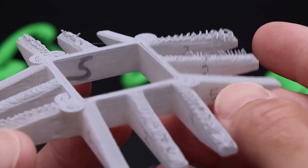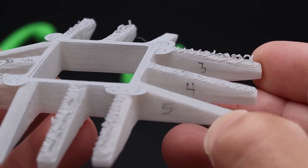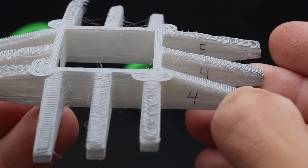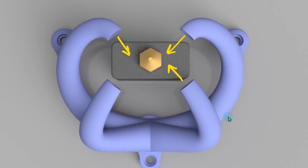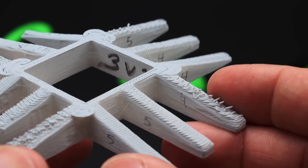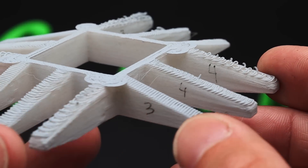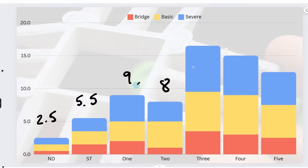The five-ducted Sentinel could have done better — I didn't do a good enough job balancing the flow and ended up sending a lot of air from the back and not as much from the other four ducts. The four-ducted version, which was just the five with tape over the rear auxiliary port, did better by a small margin. Both the five and four versions are sending streams slightly off-center from the nozzle, ending up creating more turbulent flow. With the best overall score, we have the three-ducted version. It's much more balanced, the airflow creates more of a vortex effect, air is directed around rather than directly at the nozzle, and warm air can escape fairly evenly from all sides. Three is the overall winner.